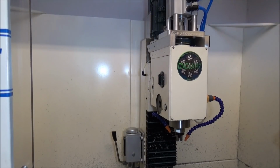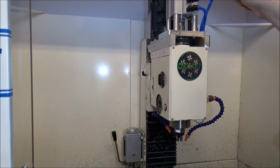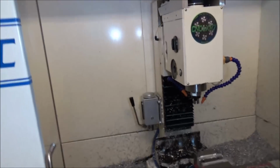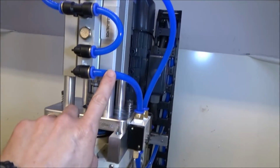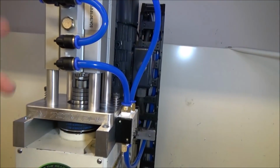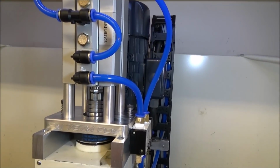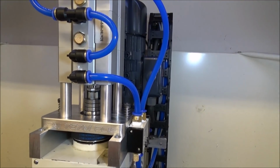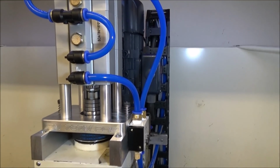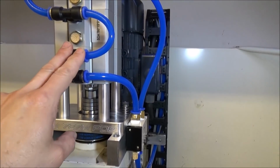I'm using an 80 millimeter bore 3-stage air cylinder. This is a double acting, so I need a supply air to press the piston down and a return to lift the piston up right here. You could use a spring return. I kind of prefer the double acting, but that's just me personally. I'm not going to be in a situation where I'm running my machine without air anyway, so for me it didn't really matter. However, some people prefer the spring return. They're a little more expensive air cylinder with the spring return,